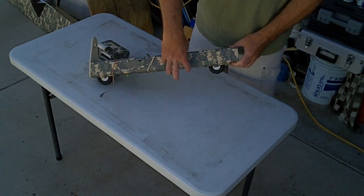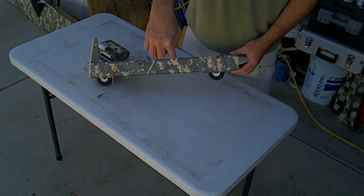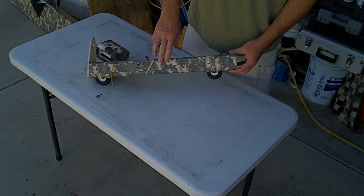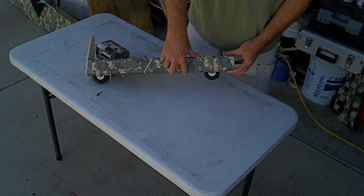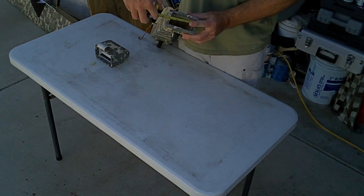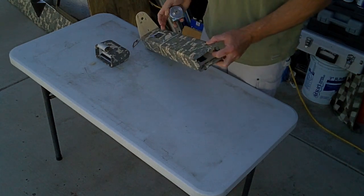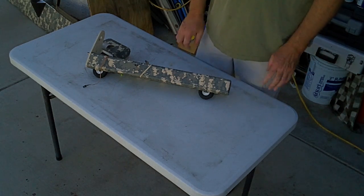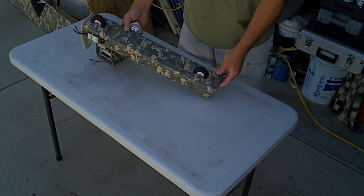And the other is that I wanted to reduce the height here. So with a side profile, when wind is blowing at a crosswind to you, this will have less negative effect on the plane. The wind will have less influence on the plane with a lower profile on the side. And it's rounded as well, so that also helps. The dimensions for this tube on the outside are 4 1/8 by 2 3/8, and those numbers really are irrelevant. You can make it big enough to hold your batteries, and that's all that's necessary. It could be square if you wanted to.